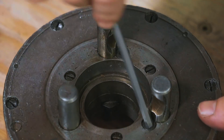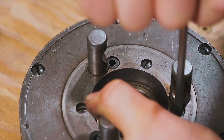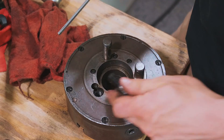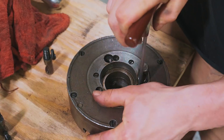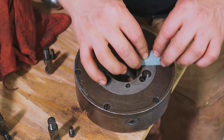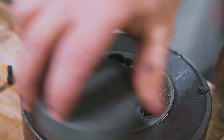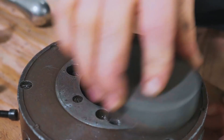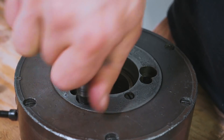After finding the right Allen key — finding it is the same thing as hiding it on your bench — I'm going to take all these pins out so I can properly stone this surface and get rid of any of the potential burrs and dings. There we go, much nicer. Let's clean these up and screw them back in one at a time.